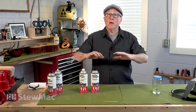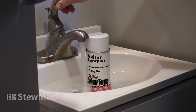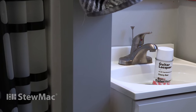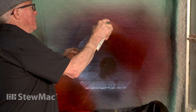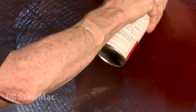A great number of professional finishers use heated lacquer. The lacquer is warmed in a tank or sprayed with a gun that's warm because it flows out better — the viscosity changes and it lays out a beautiful coat. Heating up these aerosols to the correct temperature to spray is easy to do at home. Just put it in your sink with very hot water for 15 or 20 minutes until the can is really warm. That's going to give you a much better spray than a cold aerosol. It's a finer mist, and if you spray the lacquer warm, it's going to cover better — period.